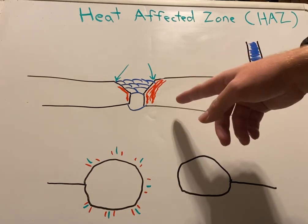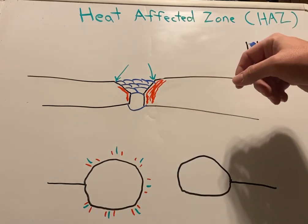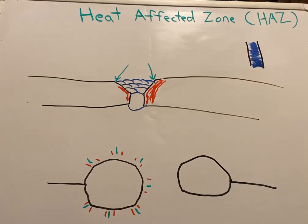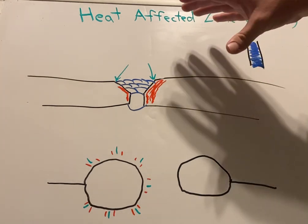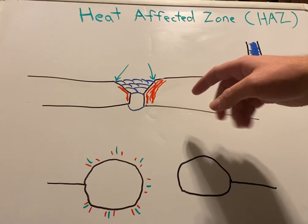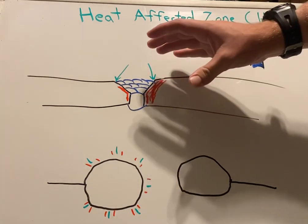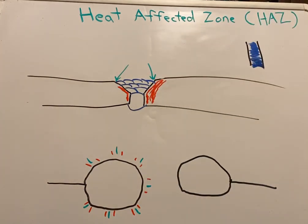And then if you're not doing a post heat, a lot of times you have to put your welded project in a container of sand. So if you're doing a large project, you have to put a lot of sand. You also put on special blankets, I forget the name of them, so it reflects the heat back in. It keeps the heat in here. Sand is used a lot of the time on cast iron, and it's just packed on it so the heat stays in this area and slowly decreases over time. And I'm not talking days or weeks or anything, hours, most likely less than hours, plural. You have it there for an hour. It depends on what the project is. It's similar to that. But I always thought it's pretty cool.